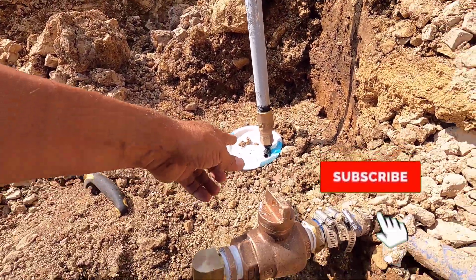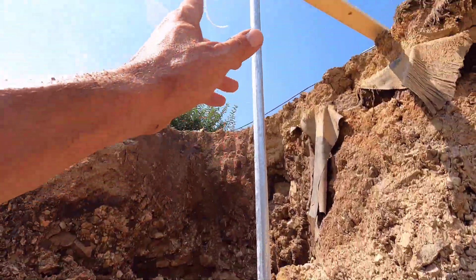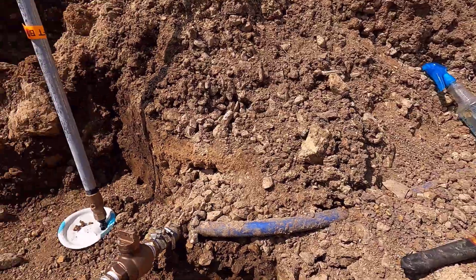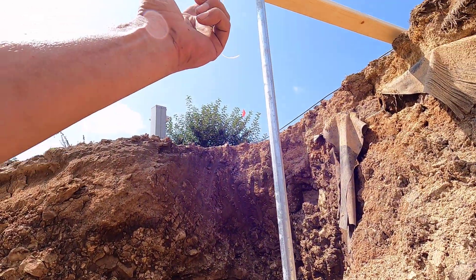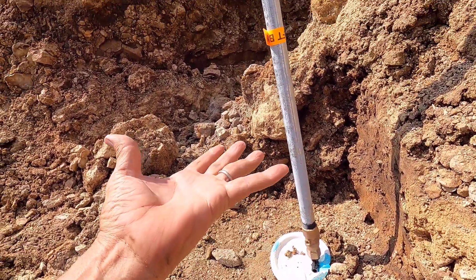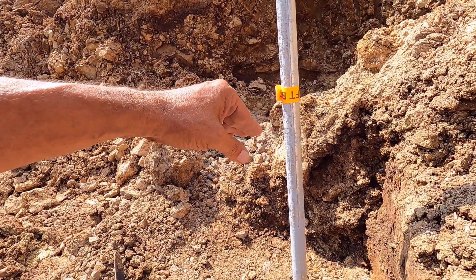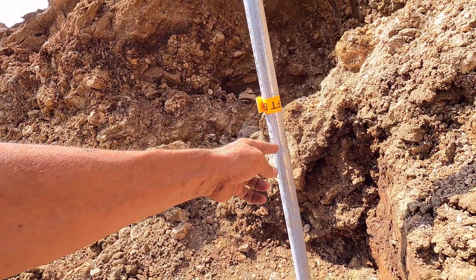What I'm going to do is build up this area until this fitting and that fitting are about level — I think three more inches that I can go up. First I'm going to put down a piece of landscape fabric, then some pea stone, and then landscape fabric over the top of that. I'm going to slide a bucket up on this and tape it up out of the way. Then I'm going to put a piece of landscape fabric at the bottom and bring the bucket down, wrap the bucket in the landscape fabric, and fill the bucket from the top with more washed pea gravel. Then I'll wrap the landscape fabric around the pipe and put a couple of zip ties on it so it'll have nice clear draining.